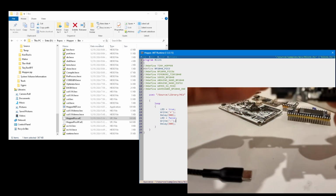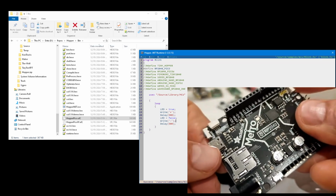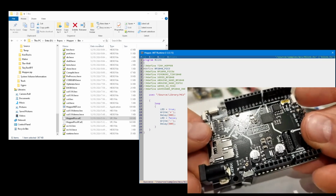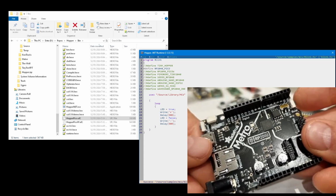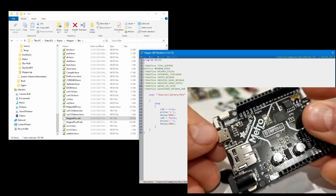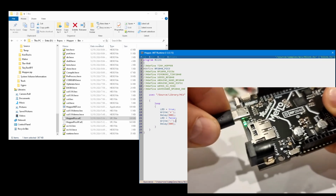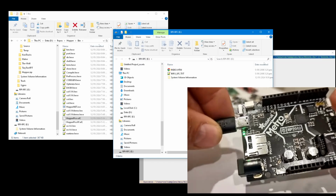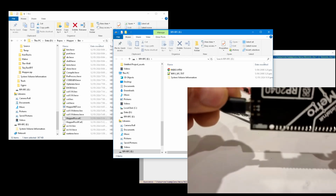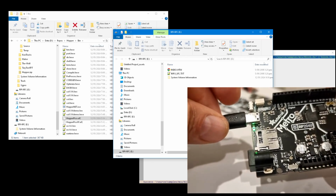And then this device is pretty cool as well, and it's slightly different. I know this one as well, but I'll just go through it. It's an Arduino form factor RP2040, so it'll work with existing Arduino shields, and it's 5-volt compatible. It's pretty clever. It's from Adafruit. It has a built-in SD card as well, and also a LiPo port. Oh no, it doesn't have LiPo. It's got two STEMMA ports. Surprised it doesn't have a LiPo charger.